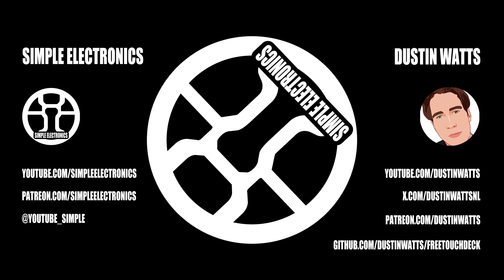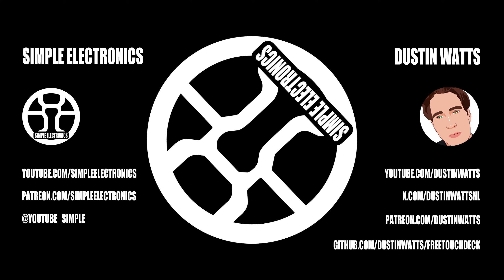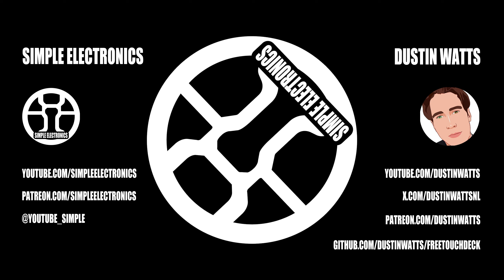It's a lot simpler than you think. There's the op amp, which does what it says — it amplifies. But there are people who are building their own op amp from scratch, because an op amp is made out of a lot of transistors, resistors, diodes, and capacitors — discrete components. In the DIY community, there are people who build their own op amps, they sound amazing, and they're usually used in preamps. Understanding it is not that difficult. But your brain has to have a little change — it's not simply making things louder. If you make things louder, you also make the noise louder. So there are some things you have to do to amplify the sound you want without amplifying the noise that comes with it. That's why you apply filters before amplification.